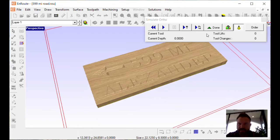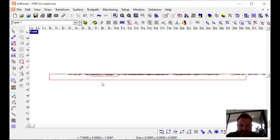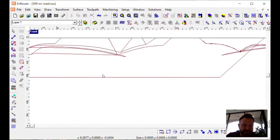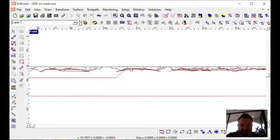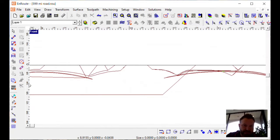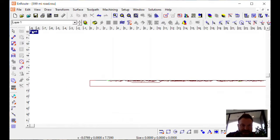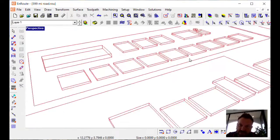Pretty nice. Now we said we were going to talk about the depth. So if we look down here, there's one spot that's actually going 3/8 of an inch deep. If you look at the 3/8 bar over here, it's right there. And here's this line. The rest of this stuff is all, you know, not even quite a 1/4 inch. So I put in 3/8, but my actual design is only going to be about a 1/4 inch deep in most areas. So why is that?